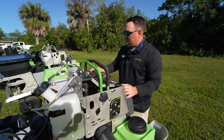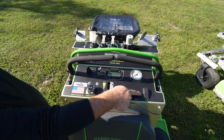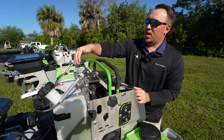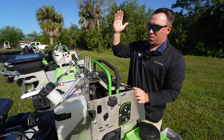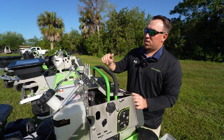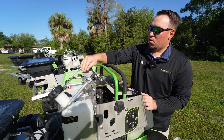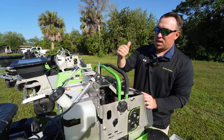When running the liquid side, our pumps run off a rocker switch so it's very easy — on and off. The booms are set up in three sections and you have control of that with these valves. When they're pointed up that means they're open and spraying, so if you want to do just a center section you can shut these off, or if you just want to hit an end nozzle you can do that.